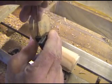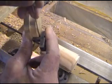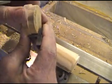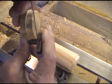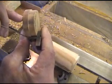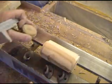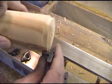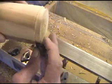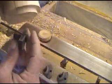That helps give strength to the hold of the chuck. We need extra space in here. We don't want this clear down in here like that, bottom out against the end of the chuck, and then space out here. And as I cut my tenons on my big one, see, I left plenty of space. It's better to have more space than not enough.